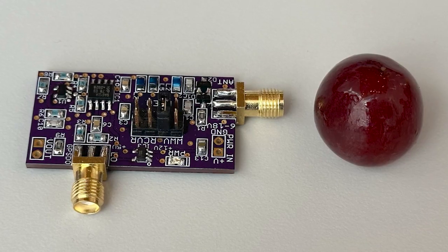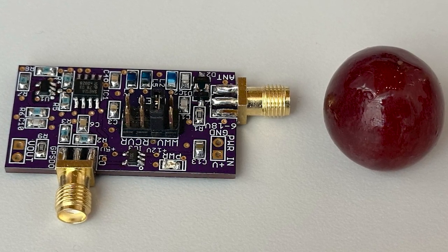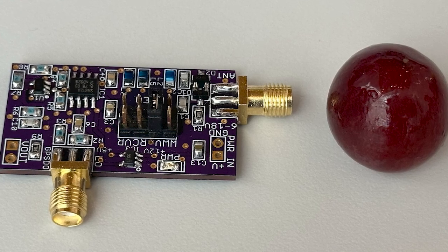The GRAPE radio was originally designed to be a very simple receiver. I tried to keep it as simple as possible, and simplicity in this case makes it much more versatile. Now that you've built one of these boards, you've built the first block of the complete system, which includes a Raspberry Pi 4 for data processing, a USB-based sound card, and a Leo Bodnar GPS disciplined oscillator as the frequency standard, which we use to reference signals coming in from WWV and measure their Doppler shift — the whole goal of this experiment.